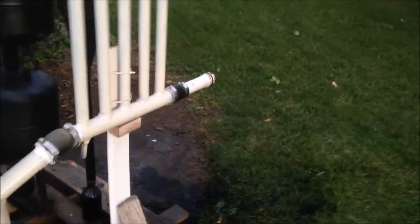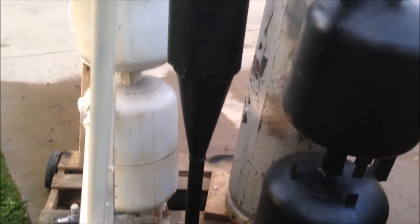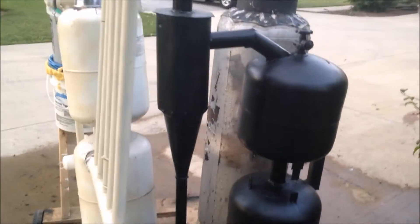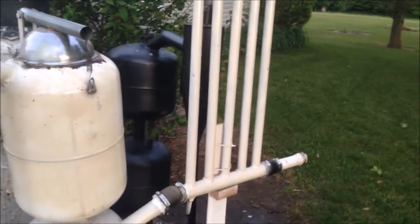The next one is poorly constructed cyclone filters. They need to be exact. What I mean by that is this cyclone filter was completely rushed when I made it. The dimensions are all wrong and I'm pretty sure it doesn't even work like a cyclone filter is supposed to. My next one should be exactly to the ones in the manual, and these cyclone filters here would be a lot better if they were actually cyclone filters that had the inverted cone shape on them.